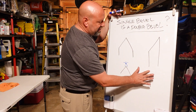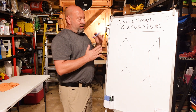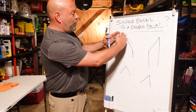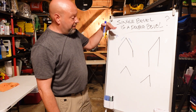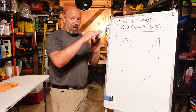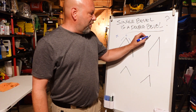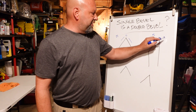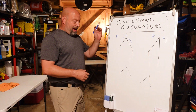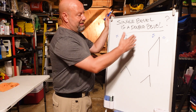Now machines are capable of doing that if you're using sanders or precision jigs and grinds, but for most of us that just doesn't do it. I sharpen my single bevels the same way I do a double bevel, with a little bit of change on the one angle. On a double bevel we want this angle and this angle — let's call it 25 degrees — to match perfectly. We want 25 degrees here and 25 degrees here to have that perfect apex right in the middle. On a single bevel, let's say we're doing 20-25 degrees here and then they want you to do zero here to create that super fine point. That is very hard in my opinion to get that sharp the way I want to.